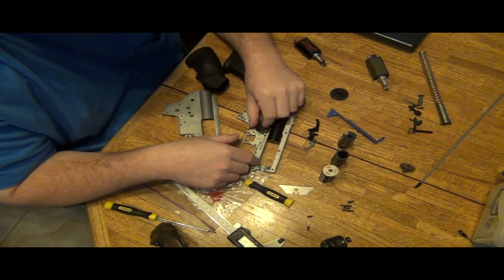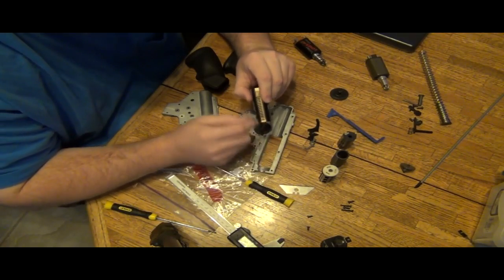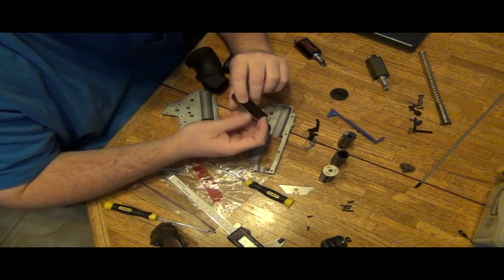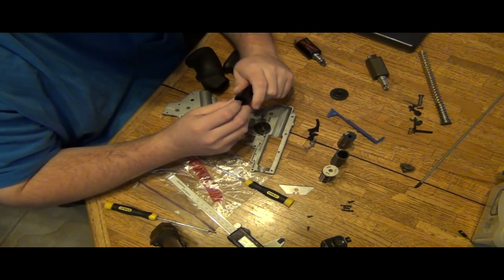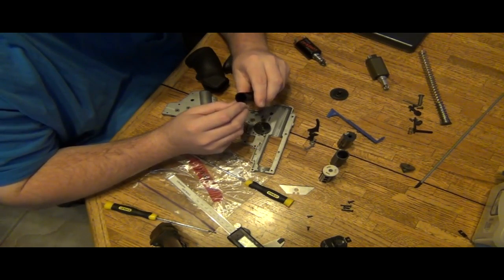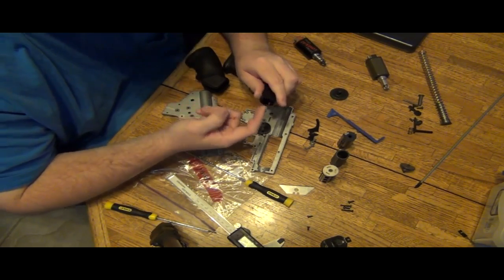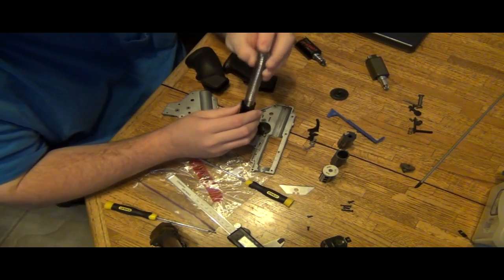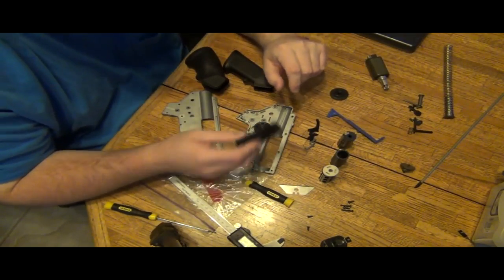Okay, so let's see, this one flows through there nicely. Then you would say, hey, I want to use this one. But make sure it doesn't have any cracks. And cracks could be still kind of usable. This one could still be usable because this is still flush, still straight. However, there's some material down here because this had been pushed up. The gear was just not going straight through here, and cracked the tooth rack, and then just pushed it up into the piston. So that would have to be kind of removed a little bit so that your spring could go through there without creating a problem. Well, look, it's not creating a problem right now, so this could probably still be reused.